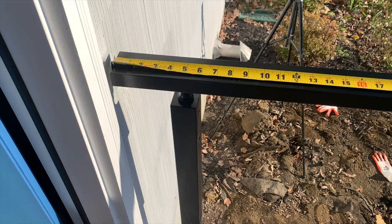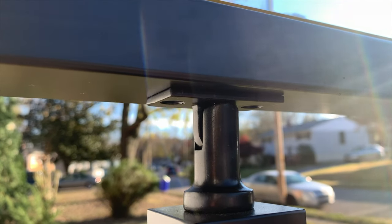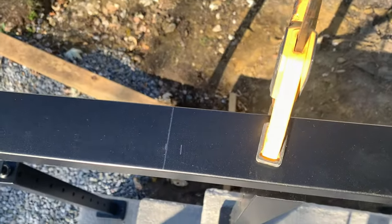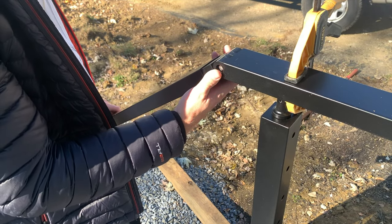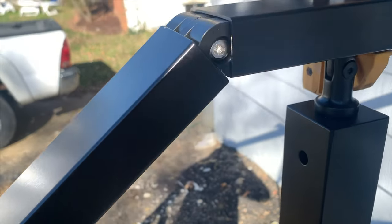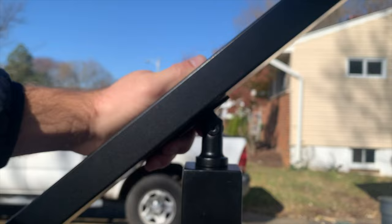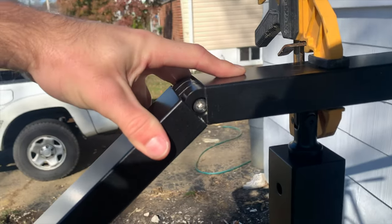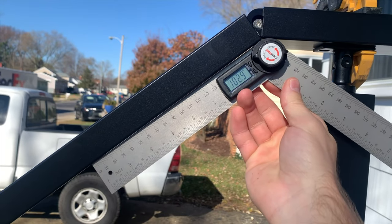Now it's finally time to install the railing. I put it in place preliminarily and used some bar clamps to hold it while I got everything lined up and measured. For my railing, I decided to make some rough cuts first — I marked at around 48 inches for the longer segment and went to my miter saw equipped with the metal blade to cut it into two more manageable segments. Then I took the adapter clip that came with the railing to find my angle for the stairs. I'm checking the bottom bracket to make sure it's perfectly flush, and then I used my angle finder to find the angle between the flat section at the top and the angled section at the bottom. I purchased this angle finder off Amazon — I'll link it in the description.